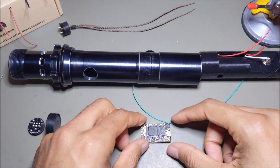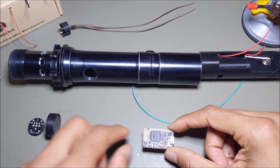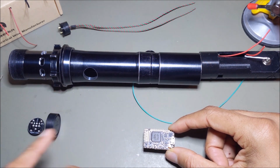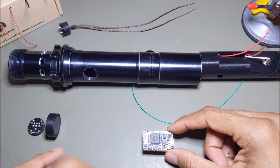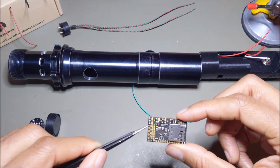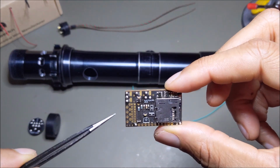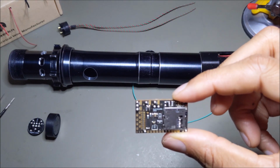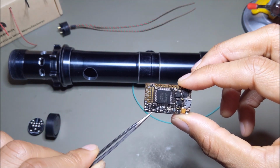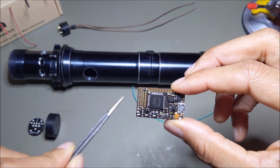So the next thing I'm going to do is try something different this time and solder the wires to the board first with a little coming out, and then from there with my spliced wires and things get that connected to the neopixel connector. So again, I have to use these three and these two right here. Get a little closer. Yep, these three and those two right there. But it's going to be on this side, so they're going to be running out, and then these two here, I'm going to kind of angle this way so that they run out from the center.